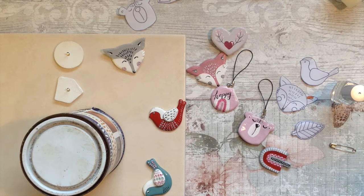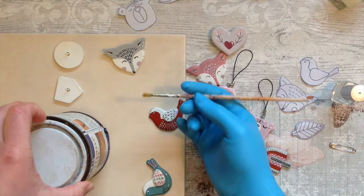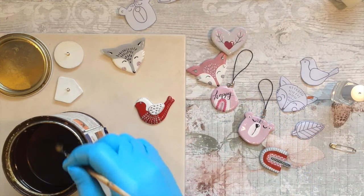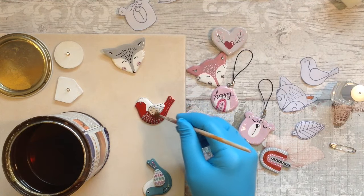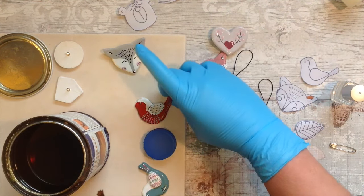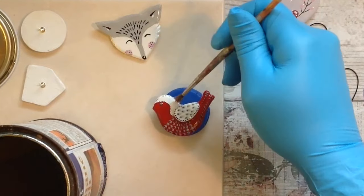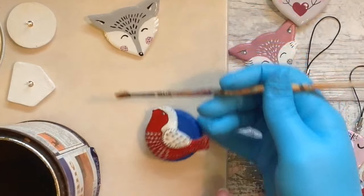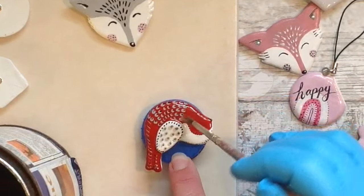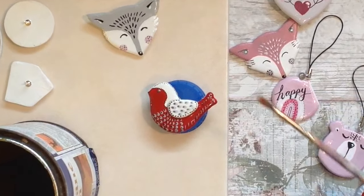Option four is a polyurethane varnish I found in my garage. Polyurethane varnish is waterproof and really durable, so I had high hopes. Use an old paintbrush in a well ventilated area — protective mask and gloves are also recommended. One or two coats would be enough as it's fairly thick; leave it to dry fully between coats. However, this gives quite a yellow tinge once dry, it gives off a strong smell, and you need white spirits to clean the brushes — so when you want a clear varnish over something white, the yellow effect is not ideal, although it does make it very durable.